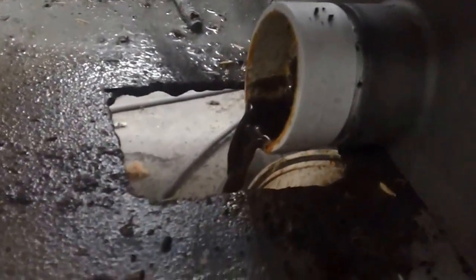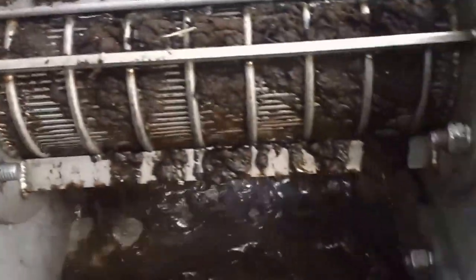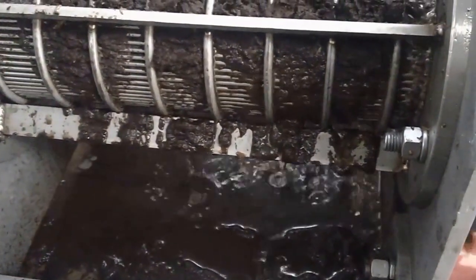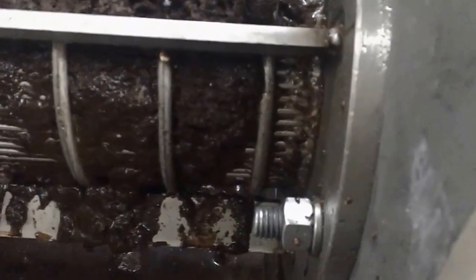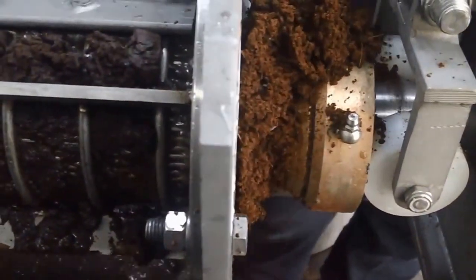Now there's going to be some — we can see new stuff coming out as we run, but some of that up at the top is worse than it would have been. We've got a pretty strong stream of press liquor right there, capturing that. More than likely we'll have some as-received and followed by press cake moisture. One thing to do is judge how dark that is in color and how light that is in color. What's coming through the screen is about the color of what was going into the inlet hopper — and look at that difference. So that gives you an idea right there.